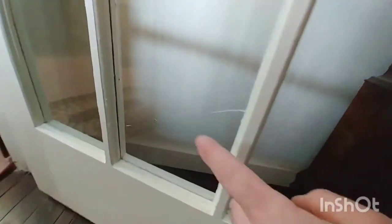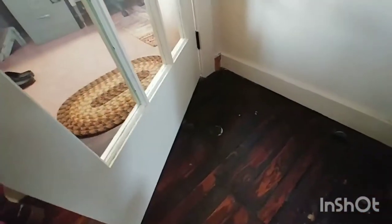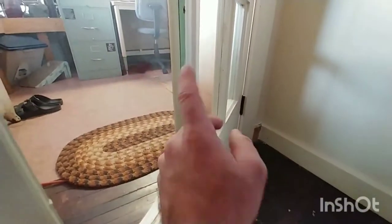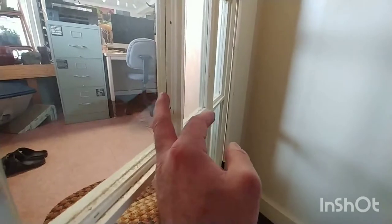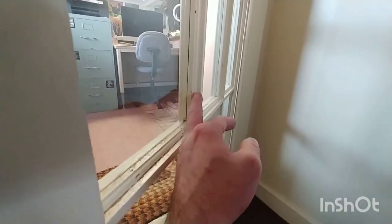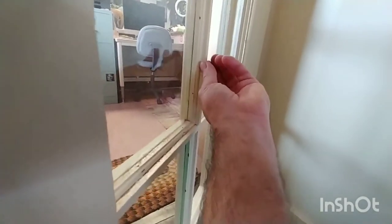Cracked glass on this one. I'm not really sure what happened there. I ended up putting these pieces back on. Oh, I missed one. With crown staples, half inch long, because I could shoot those, and any other, like, even tapping on the tack. So I backed the tacks all out of these pieces that we saw before, and then I put the piece in place. I wasn't so careful as to make sure they went back in the same place. They were making a new hole when I tapped the tacks, or tried to tap the tacks back in. Some of them went, some of them wouldn't go, because this is oak. And they're really small. And there's a lot of bounce in here.